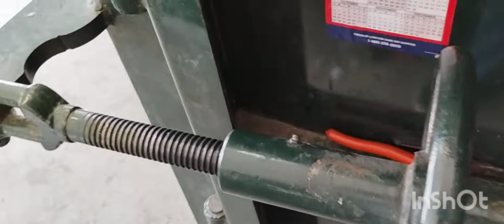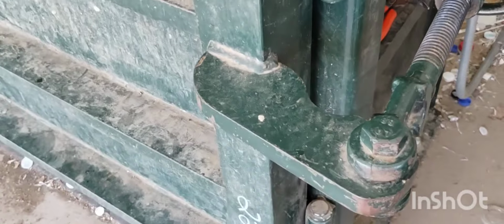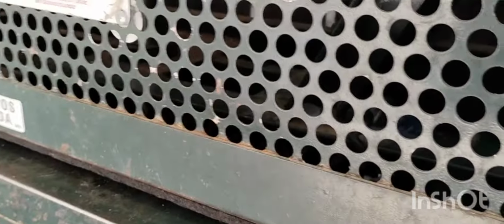And that allows that switch behind the door to not trip. There's a switch right back here, and it trips somewhere back there. There it is. It trips. So, if you get that really, really tight, it won't trip. It'll allow you a bigger bale.